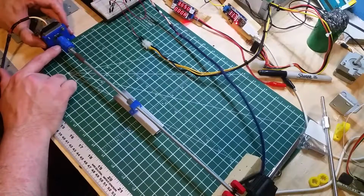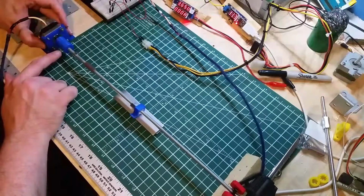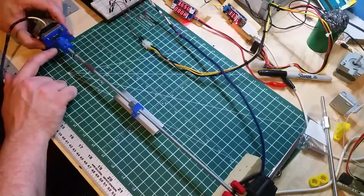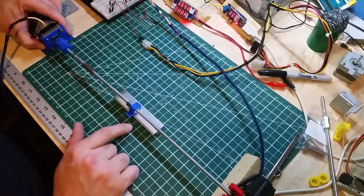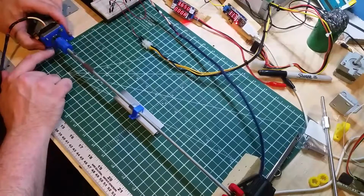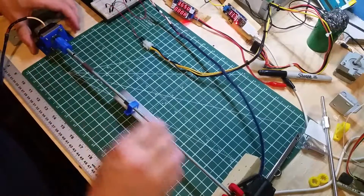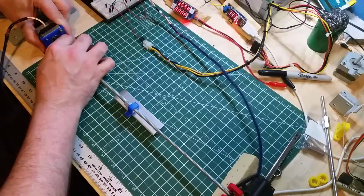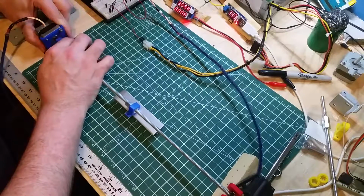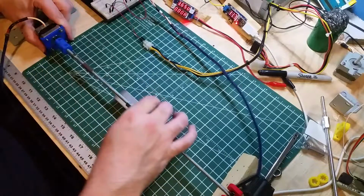As you can see, there's an issue with the coupler here. I guess I'd have to build, you can see the flexing now, I have to build a flexible shaft in that coupling, or see if the actual flex is in the Acme rod, but I do believe it's in this coupling here. Sometimes I can just about get rid of it.